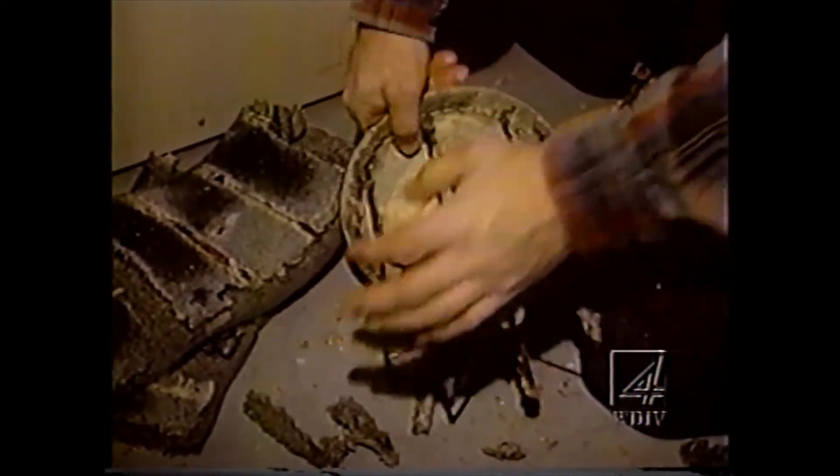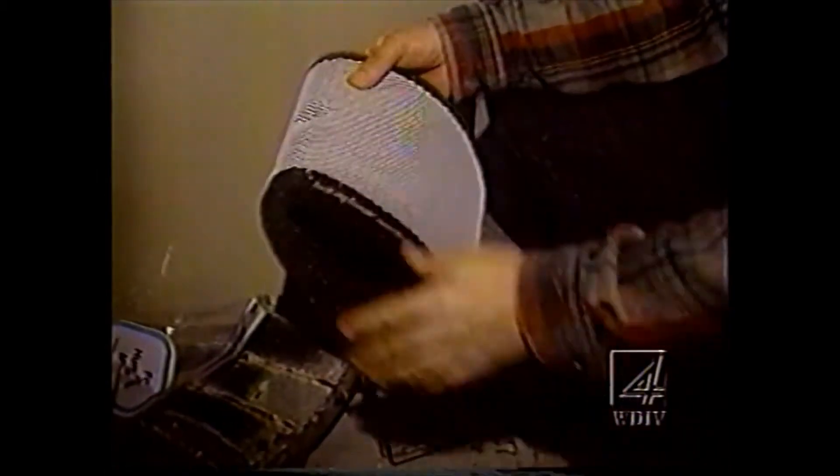There are new different types of humidifiers nowadays too — it's a continuous-run type of humidifier. It has to have a floor drain in order to operate, but it eliminates this pad that gets all crusty and messed up. See, this is the way it's supposed to be — it's supposed to be like a big sponge. It fills up with water, the hot air circles past it and picks up moisture through it.